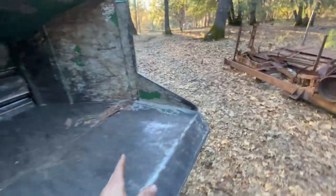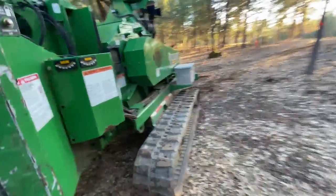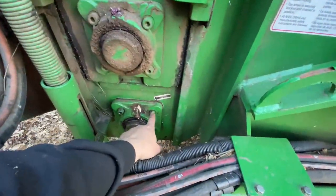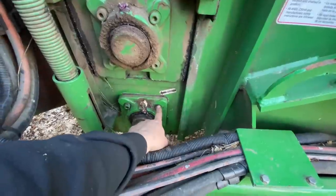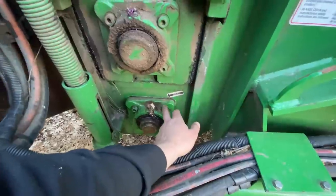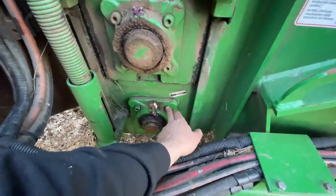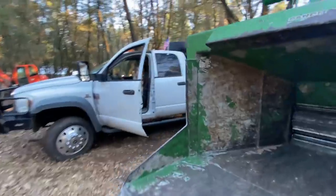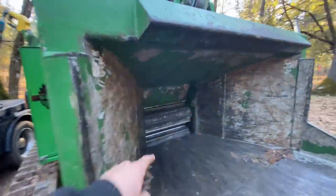But the reason I say that side walked out is because the same bolts were taken out by us and put back by us on this side and the other side, because to take this lower feed wheel out, you got to take both sides out. These ones didn't walk out at all. They were perfectly fine. So I'm thinking since that other guy didn't have those rubbers on there, that was the cause of the problem.